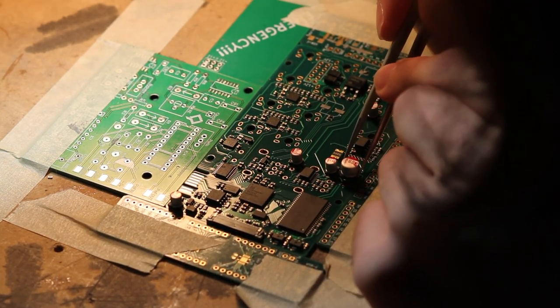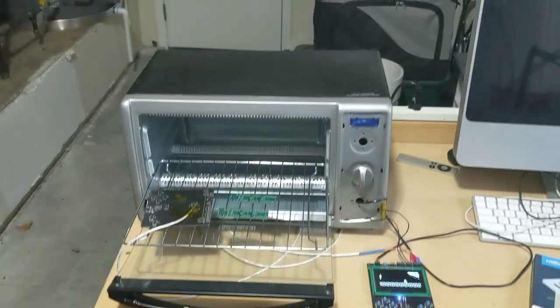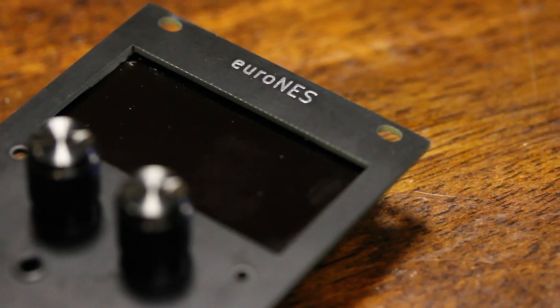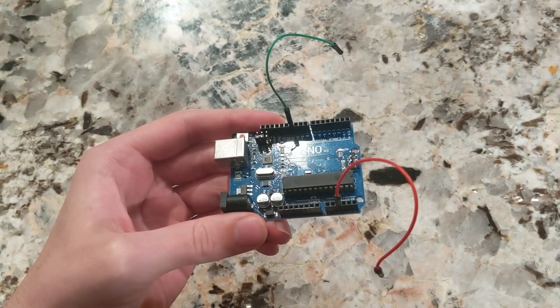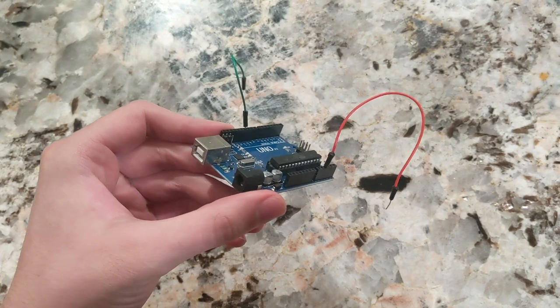The industrial assemblers also have big ovens that they run the boards through to melt the solder, but I just used my modified toaster oven. So I've assembled my final revision, and you've seen that it produces audio. But what's driving the show? Normally you'd use a microcontroller for this sort of thing — a little CPU on a board with wires that you can hook up to different things, like a DAC or a knob.